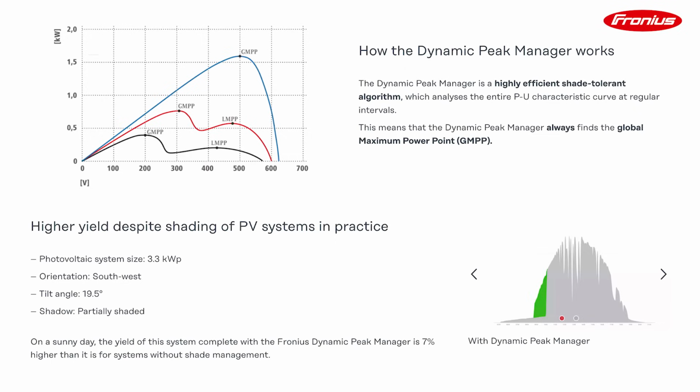Do you have an example of a common inverter that doesn't? Sungrow doesn't, I believe, unless they've changed in recent years. To me, it was SMA that had one. GoodWe didn't, for example. Really, it was SMA and Fronius that had it. So what is the benefit of a global maximum power point tracker over a local one? Simply speaking, if your panels get shaded, the inverter will get stuck in a bad position. So it basically puts it in four-wheel drive and gets it out of that position. It helps prevent losses due to shading.